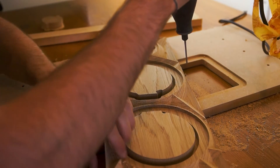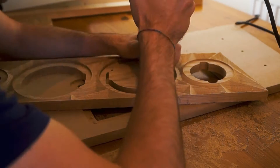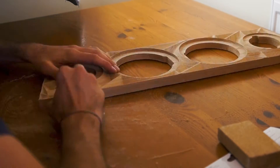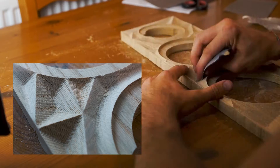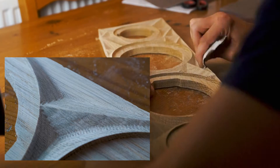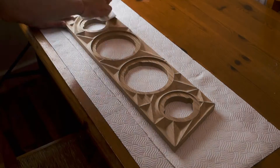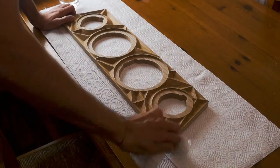Back in my house, we're cutting out those little bits the CNC didn't finish — we didn't want to go too deep through the oak and into the CNC bed. If we were to do this again we'd probably have a sacrificial bed. This is where the real time comes in: you can see I'm sanding away at those crosshatch patterns, which took quite a long time, but you can see we're going for a nice smooth finish on top, ready for Danish oil to be applied.